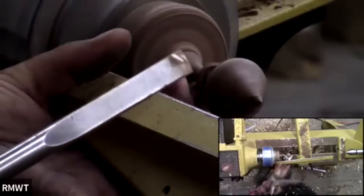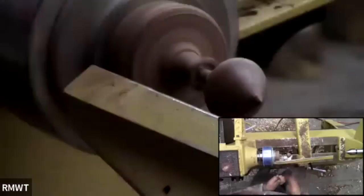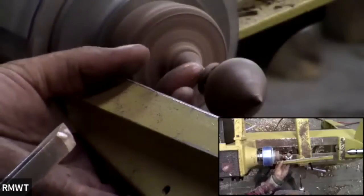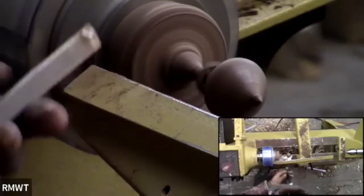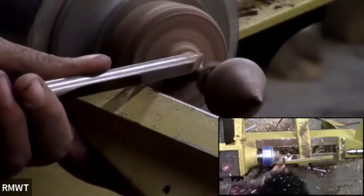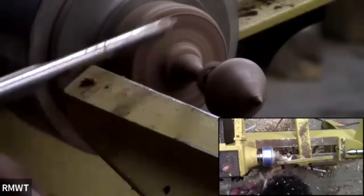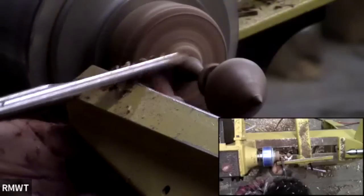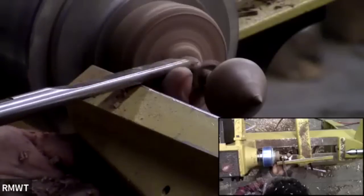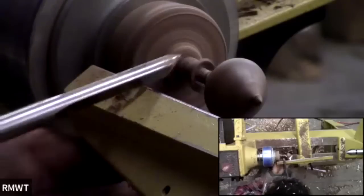And if we get that to stay right in there, the good thing about making a little design element right there is that oftentimes the bead will just stay, not always. It can sometimes just stay right in that area. And I guess it's not going to. Yeah, there it goes. It's staying. That's good. And that'll allow me to be free of this other side to then make a sort of rolling cut. I have plenty of diameter to remove over here. Plenty. Let's do a little bit more. Round this over. And yeah, I think I'm happy with it.